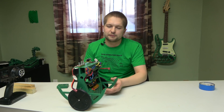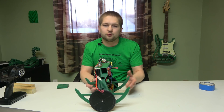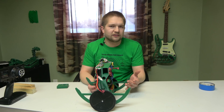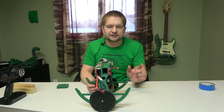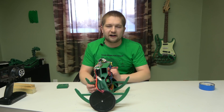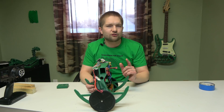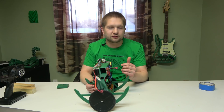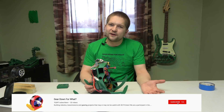It was a mistake, but it ended up being beneficial — it provided a dead zone where the car would stop trying to spin the wheels. So in this car, instead of using the wrong data type, I used the correct type but added my own dead zone that I can size myself. Right now that dead zone is set to 0.3 degrees, so if it's within 0.3 degrees of its balance angle it stops trying to spin the wheels. I also felt it important to zero out the integral band on the PID when it enters that dead zone, so I went into my PID library and added my own function to control whether the PID computation would clear the integral band.